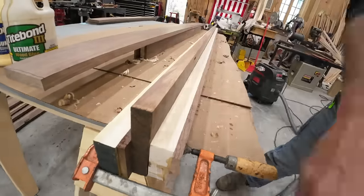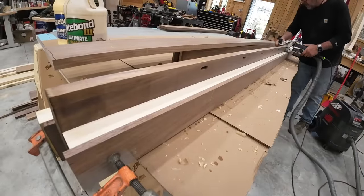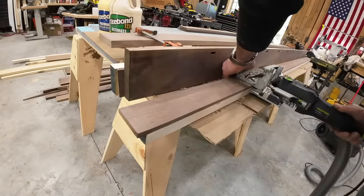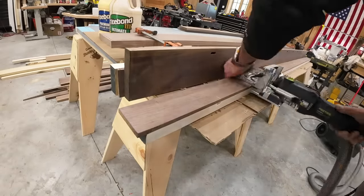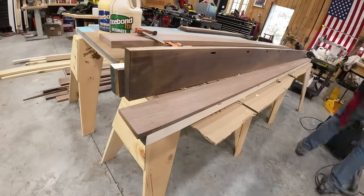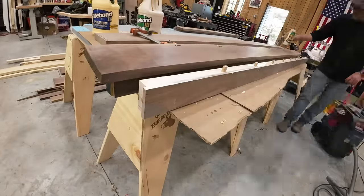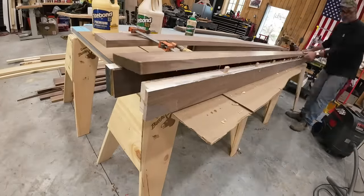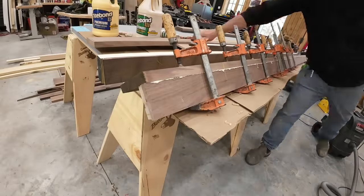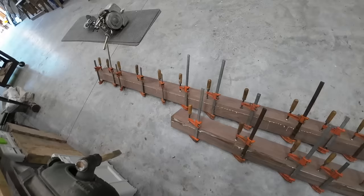One of the most important things about making a pool table, in my estimation, is to make sure it's absolutely sturdy and absolutely strong — you don't want any movement whatsoever. That is why I'm using my dominoes and why I'm making this fairly thick. Ultimately you'll see how it all goes together and how thick it becomes, and of course I'm using Titebond glue to make sure nothing ever comes apart. Lots of clamps — I used more clamps on this than I did on the boat.